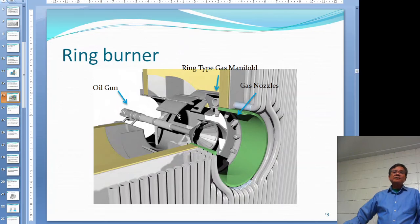The louvre is somewhere around here. When the air comes out it goes in a swirling motion and burns on this side of the water tube. That is the wing-type gas burner. They also have an oil gun in there — so this is probably a dual fuel boiler too. If they want to burn oil they just pull the gun out to somewhere around here, and then they can burn oil. Right now the gun is pulled back so you can burn natural gas.